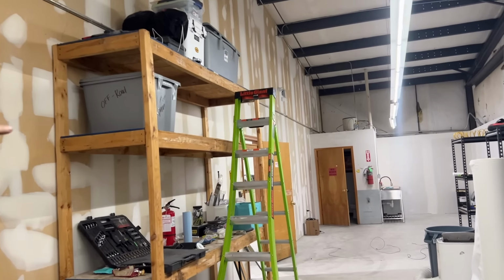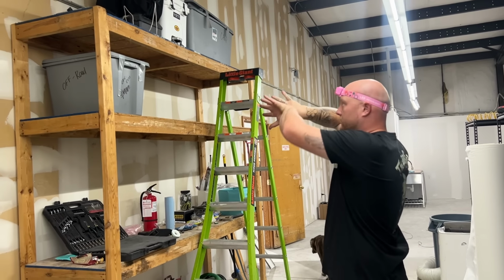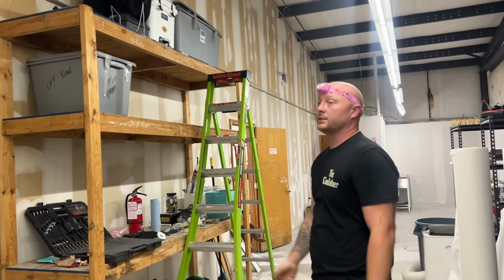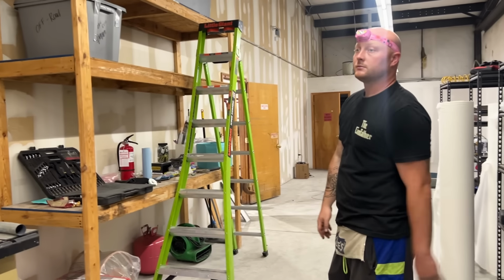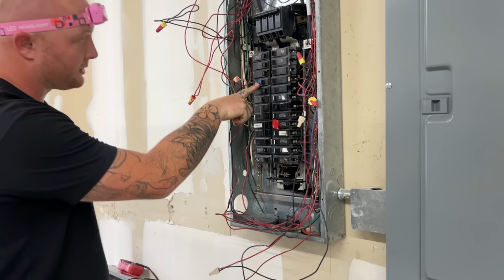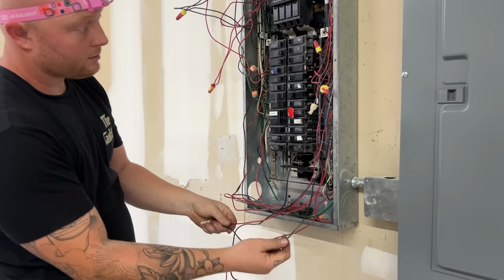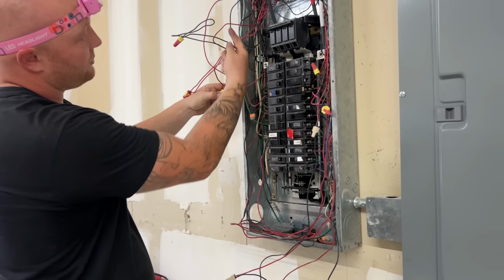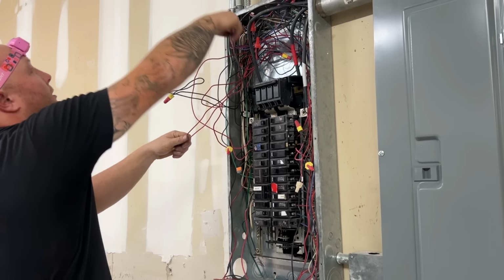I'll just stop right there. I'm just going to illustrate. It gets to the wall down here, goes over the wall, down into that conduit, and disperses like 20 different ways. Actually, it hooks to one. I don't even know how they did it, honestly. Either way, I took that jumper out, and now that doesn't power anything. This one is actually useless now. This is the one that I said powers the 2 red wires, but it's got a red wire that comes out of it, goes all the way over to a black wire, which goes back over here to this black wire, which goes back to 2 red wires. This red wire goes into our conduit. This red wire goes up to a connector here, comes back down to this red wire, goes into this red wire, and goes back up into our conduit.